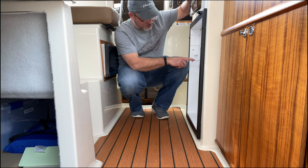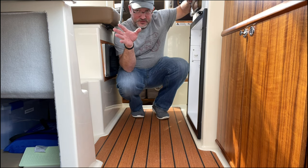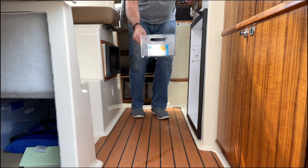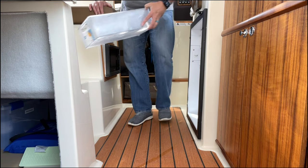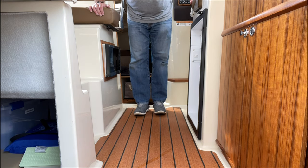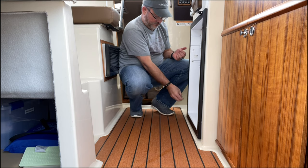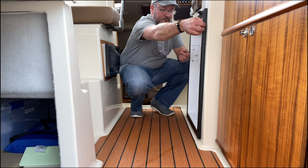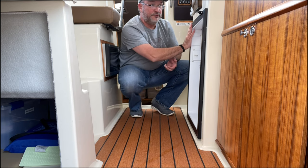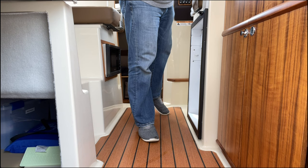I had the light on earlier to know when power was out to the refrigerator. I've gone and turned the house battery switch off — still plugged in for the battery charger, but the house switch has cut power and the refrigerator light is out. I'm going to remove the tray — a little bit of water is coming out where it has defrosted. That's okay, it's a boat. I'll dry that up with a towel in a few minutes. There are four black caps that attach to the refrigerator — those cover the four screws that actually hold the refrigerator to the fiberglass.